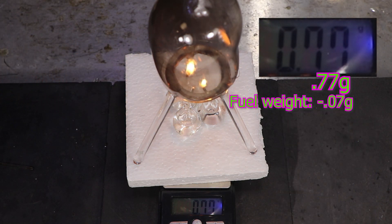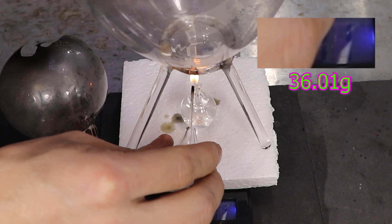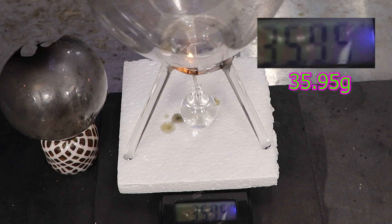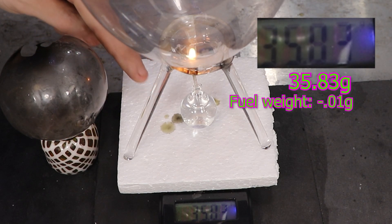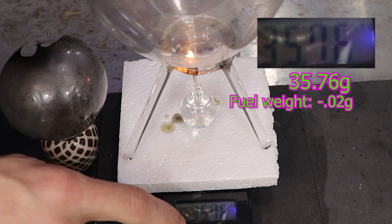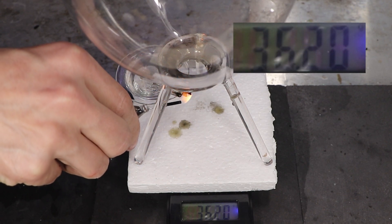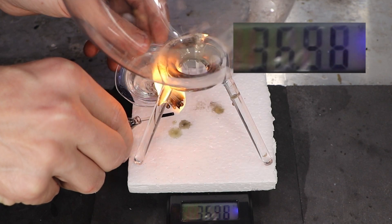I was originally going for a hot air balloon but this design reminds me a lot more of a sky lantern — sort of the same concept but made of paper, a bit larger, and carrying its own fuel source. The paper is much more insulative for heat, however it burns very easily and so can't take nearly as much heat as I'm giving these vessels. To get the most advantage I can I'm blowing the walls out so thin they weigh half the weight of printer paper. I was hoping with enough heat I wouldn't need such a large vessel, but I didn't factor in the conductivity. With more space we did get more lift off a single candle — about 0.23 grams compared to 0.07.